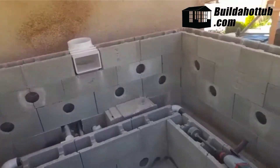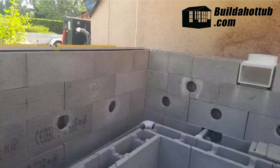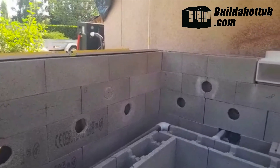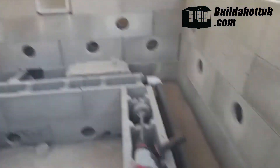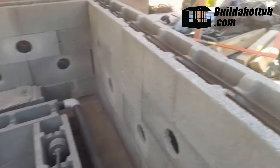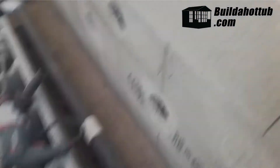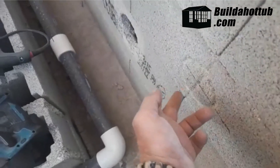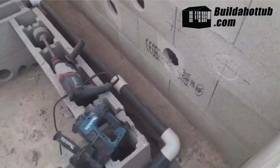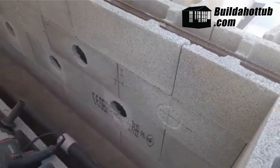So I've had to think of another plan. Whatever I'm doing — whether I'm using hammer, no hammer, SDS, SDS Max, anything — it just splits every block. So what I'm going to do is a bit of a change of plan: I'm going to fit the bottom row of gunite bodies in, and then I can pour concrete down here into every other hole, every other cavity, leaving the ones that I still need to drill without concrete. But then everything will be tied together, the blocks won't move, and if they do split, it shouldn't really matter because they won't actually fall apart before I finish getting a hole through. So that's the plan.